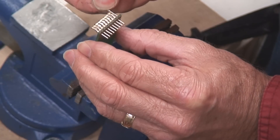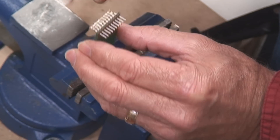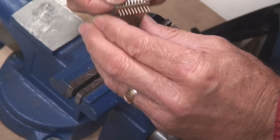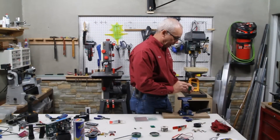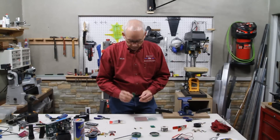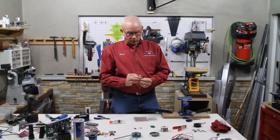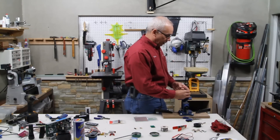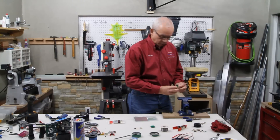Now on the last pin that you put in, you'll want to have it facing back against the grain of all the others. That way your last one will have a rounded edge just like the other side. Then what you're going to want to do is take these pins on the side you're going to be soldering on and push down to make sure that all of the pins are lined up evenly on your circuit board.